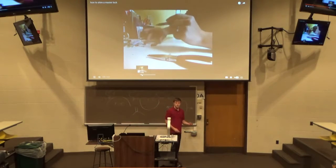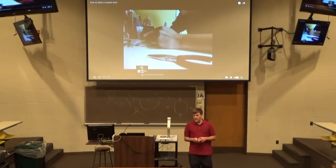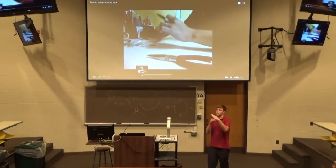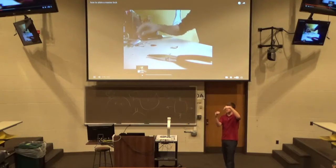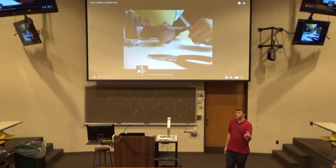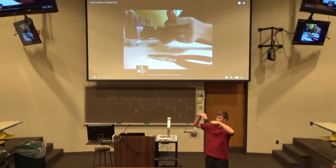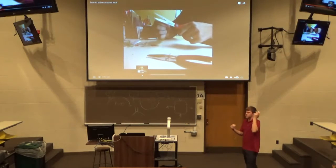So pretty much the way a lock works, we'll show you this on this one too. It has a little notch in it. When you lift the Master Lock, generally that actual U has a little notch in it. That acts kind of like a normal door, where it's just spring loaded in there. So the idea is if I just shim a piece of metal between that little spring cam and the actual shaft, I can lift it up and it's totally fine.